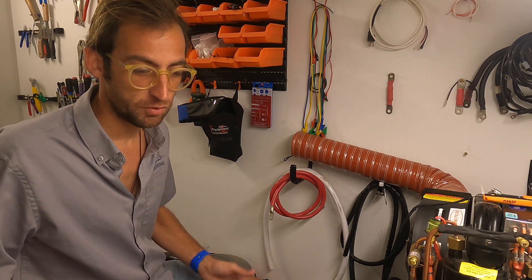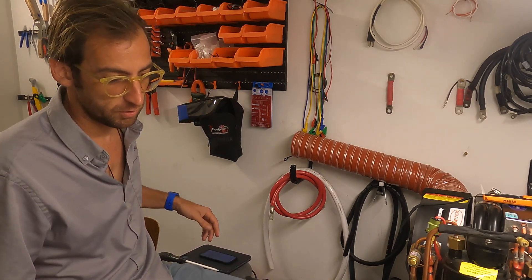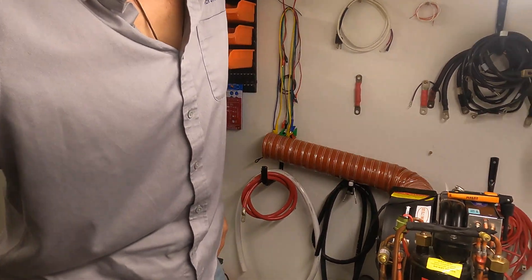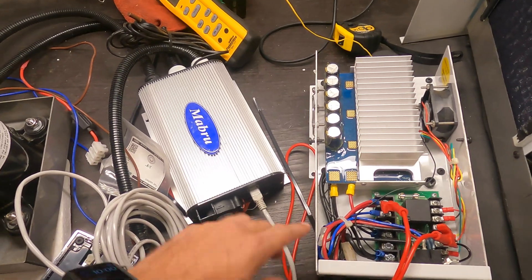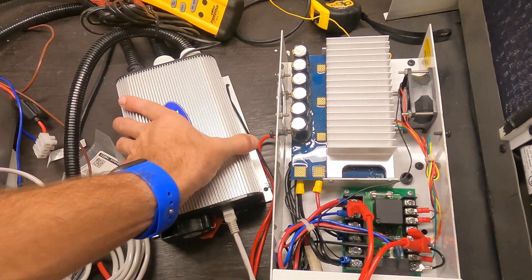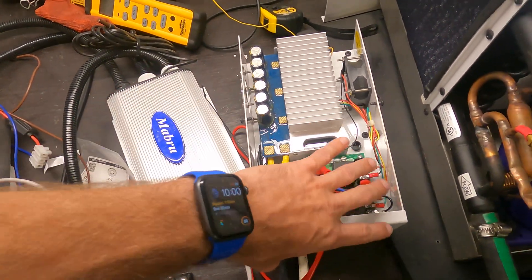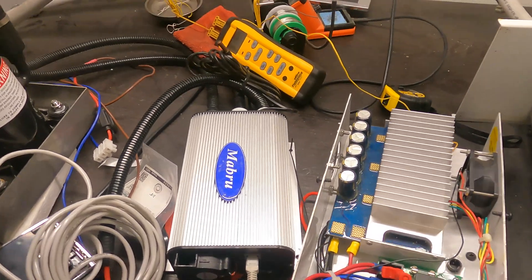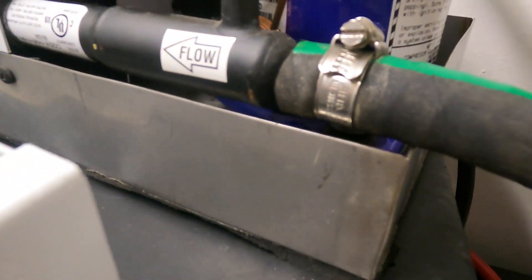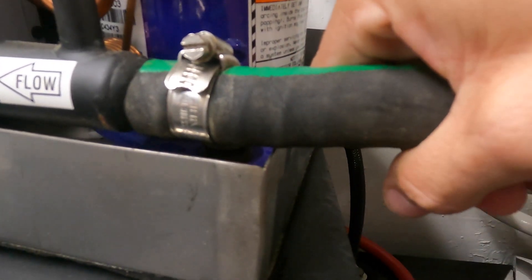I'm curious to know what everyone else thinks and if there are any other tests you'd like to do. Another difference is going to be when we compare the size of the electrical boxes — this is the competitor's unit and this is ours. I would say it's a better part of twice the size, so you also have to find room for this electrical box. Another oddity is the water connection — you can see that this hose is sitting on the pan, and with time we're just going to chafe through this hose and eventually have a water leak right there.